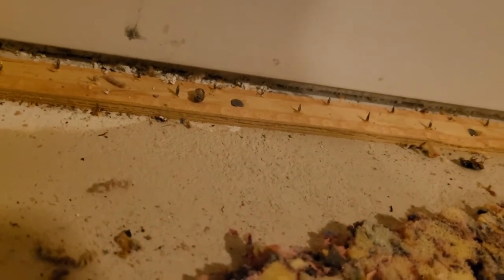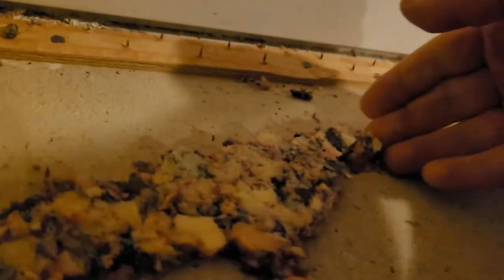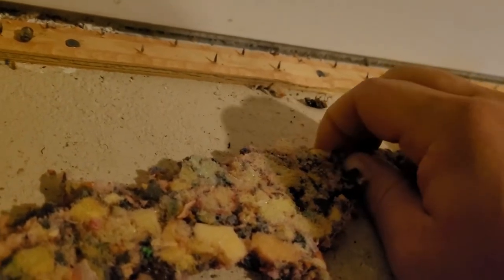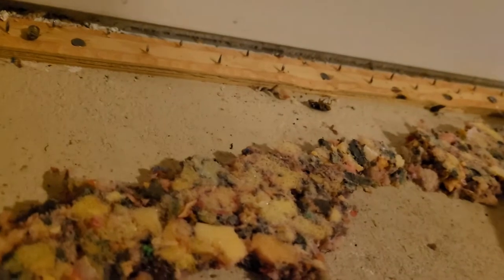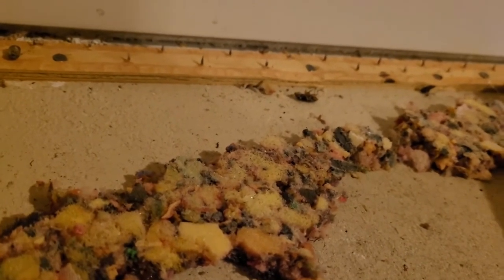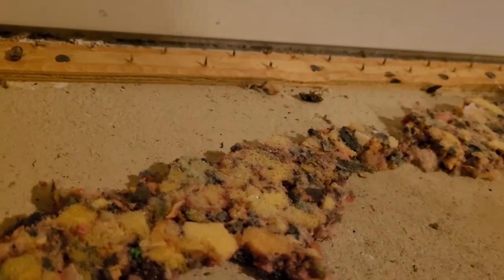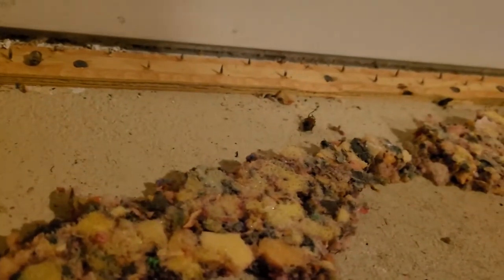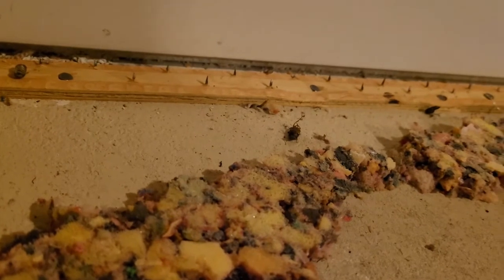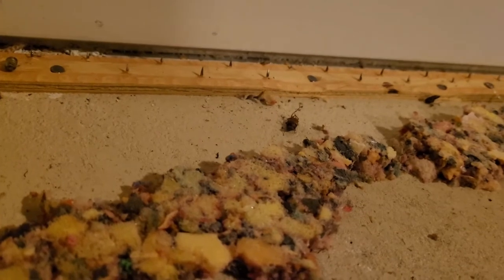There's a secret weapon here. You can either go with a crowbar, if it's got a nice broad blade tip, getting this pad off of the concrete that it's glued to. One of the ways that you can do that is with a garden spade, or if you've got a really flat chisel, to get under there. And then the classic thing for a tack strip is to use a pry bar. In a pinch, you can use a standard screwdriver, but we're actually going to use a shovel.